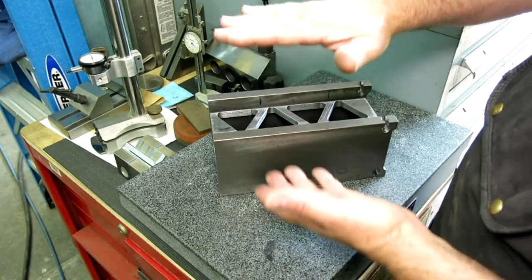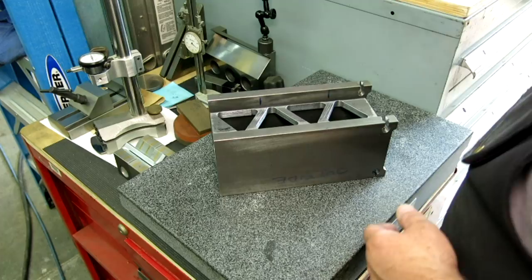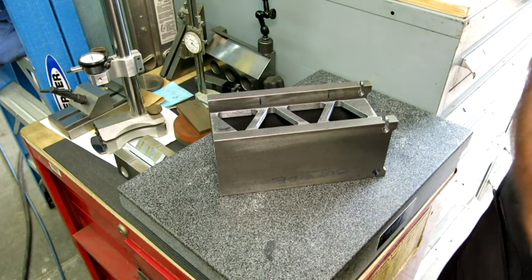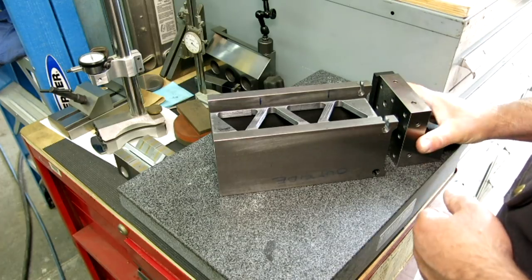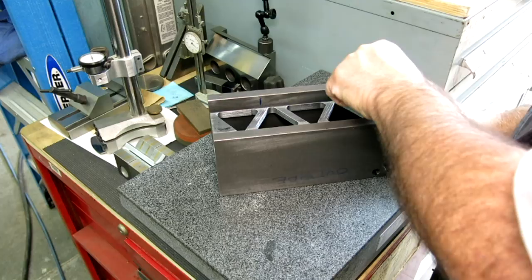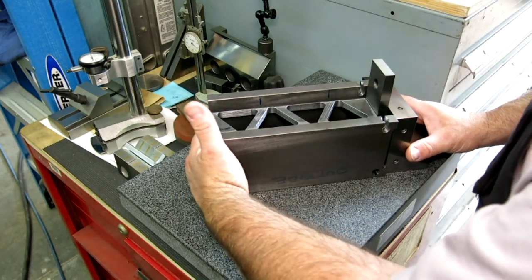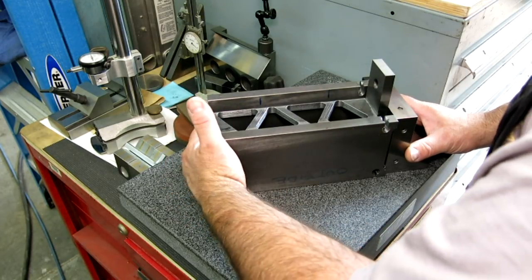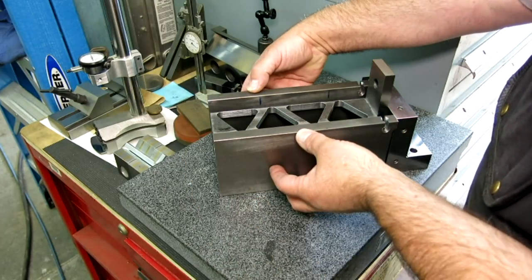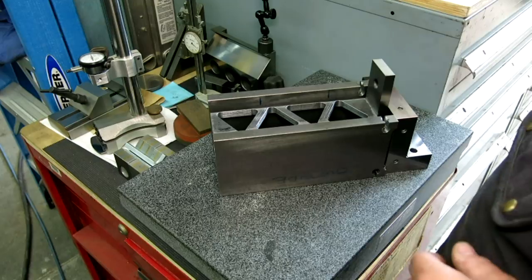And then I want the tube in the center of this plate here, so I played around with the height of those spacers under there to get it in the middle. And this should get the ends nice and evened up. Okay, and we clamp it this way, and then we put a few welds in there.